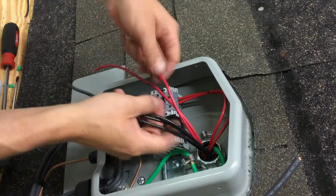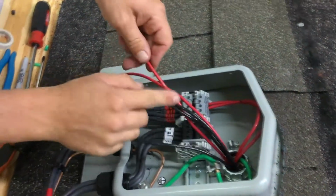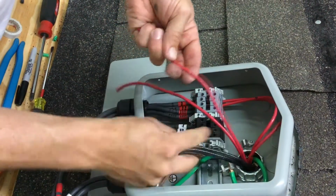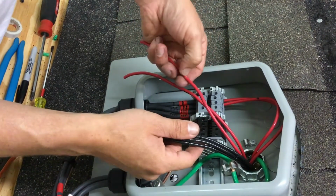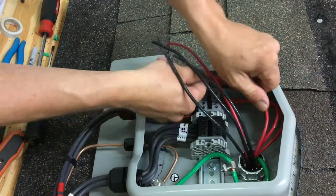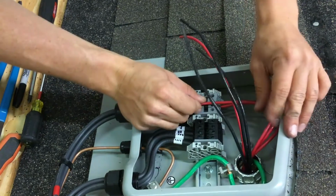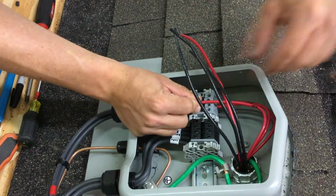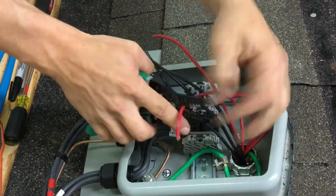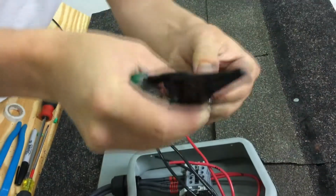Okay, at 3, that is 4. Any kinks in insulation like this I normally don't like to use. I like to have my wires a little longer. So I would normally pull this out, and as you can see that kink in there, it's just a bubbling of the insulation. So we'll see how it ends up here. It's going to be in the SOLADECK, but it'll be alright. 1, 2, there's 3. We're definitely cutting this part off, which is bad. That's from the wire being bent over in the reel. That'll happen.